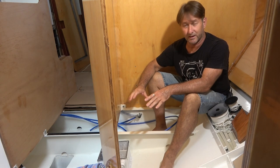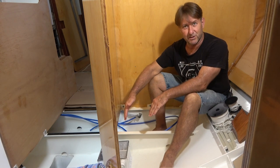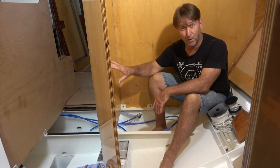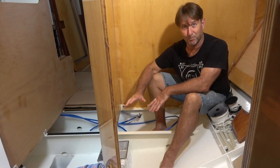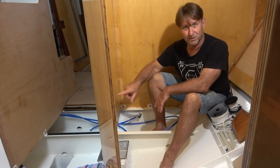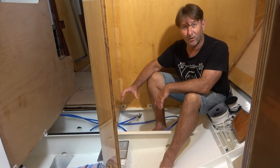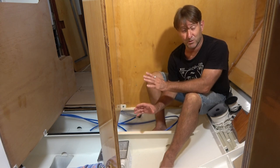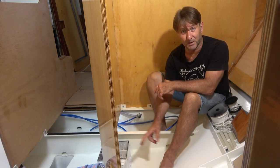And two other things with that, because I'm not going to be mounting it right below where the drain is, I will be able to site it as you see here, which will be straddling beneath this bulkhead, which means that when it comes to any sort of servicing or maintenance, to clean the strainer, replace a pump, check the wiring, whatever the case may be, the access for that is simply a matter of removing that cabin sole piece in that companionway there, and that will give full access. That means that now I just need a small hole with some sort of conventional shower grate and fitting, which will be discreet, and the plumbing will disappear into the sump.